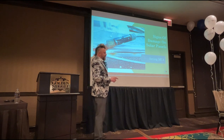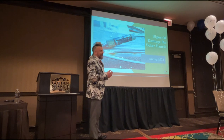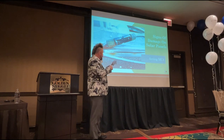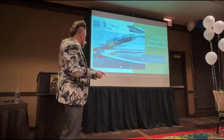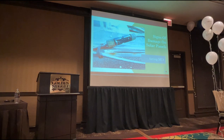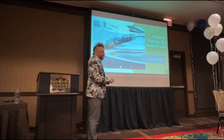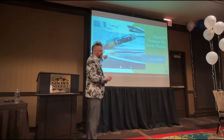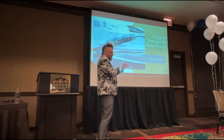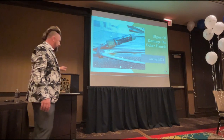If water has got into here, this cable inside of here is normally shiny, isn't it? It's going to be copper cable, so normally you've got that copper color. This cable is going to turn black because water has got to it. So when you take the connector off, if that cable is black, you've got to start trimming it back. Depending on the angle of that cable, that water might have seeped back 30, 40, 50 meters, in which case you've got to fit a whole new length of cable. If it's pretty flat and it's only gone back six inches, you can cut the cable, and if you've got enough slack, you can reconnect it again. But you've got to get rid of the black. That's in a nutshell what that job is. These also have a special tool to tighten them up to make sure they're at the correct torque and all the rest of that. So there's a little bit involved if you're going to get into that. But it's really good revenue, really good revenue.